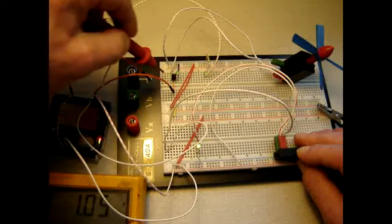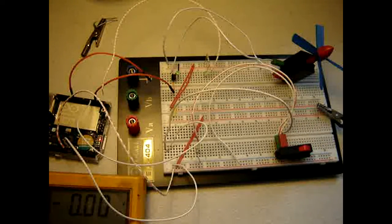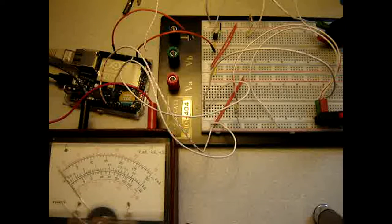The only thing I can do now to see if there is some difference is use the analog multimeter. See if that makes a difference, because that needle is moving slower than this digital one. Let's do that. So, although the digital multimeter is more accurate where it comes to decimals, this one is slower, so if there's any movement you can see it.